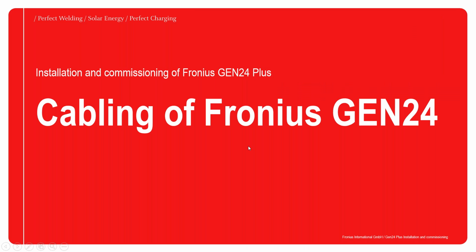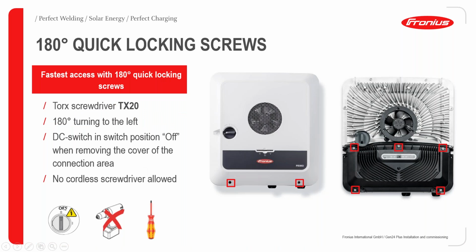We should now go through the cabling of the Fronius GEN24. The one unique feature about this inverter is the 180 degrees quick locking screws. For this, all you need is a Torx 20 screwdriver, and to perform locking and unlocking, you don't need to turn clockwise or anti-clockwise as we usually do for conventional screws. What we have installed here are 180 degrees quick locking screws. That means you just have to turn to the left or right, depending on whether you want to lock or unlock. Because of this, no cordless screwdrivers are allowed, because you might end up damaging the screws and the thread.